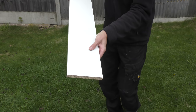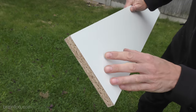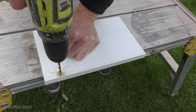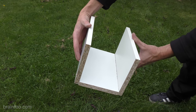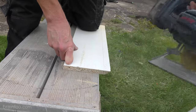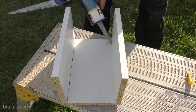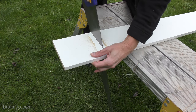The first thing we're going to do is build the mold, and for that I'm going to use some cheap six-inch melamine chipboard from the hardware store. We cut this into four equal lengths to form the top, bottom, and sides. The sides and bottom can be glued and screwed together to form the basic shape of the mold. Next we need some 45-degree fillet strips, so I set the circular saw to 45 degrees and cut the timber down both ways. I'll stick those strips into the base with some silicone sealant and wipe off the excess.